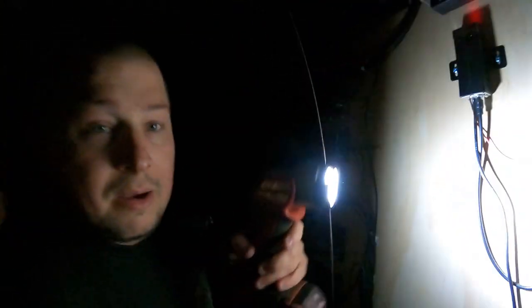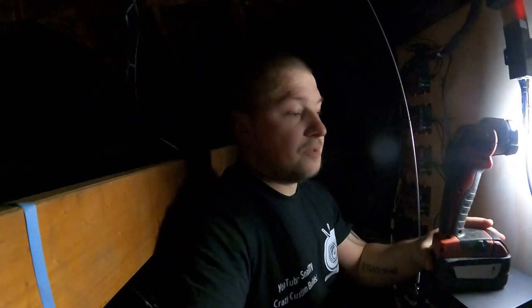It's also Bluetooth, so Bluetooth runs throughout the whole house. He's also got a radio, and that there is the antenna booster. Everything has come up really well — the whole house sound system runs off 12 volts, stays pretty cool, and everything's good. All the wiring from up here feeds down to 8-inch speakers installed in the ceiling throughout the house — bathroom, lounge, living, dining, everywhere.